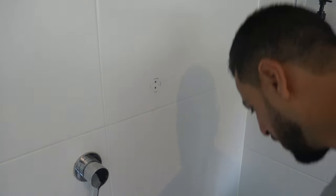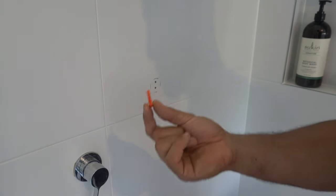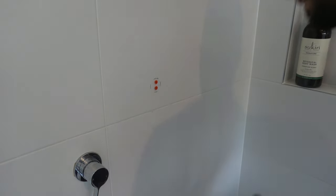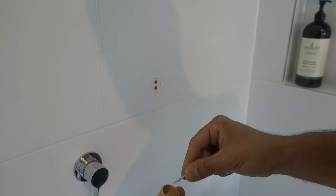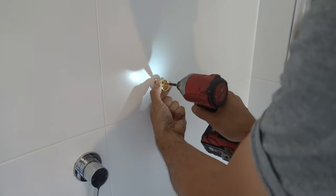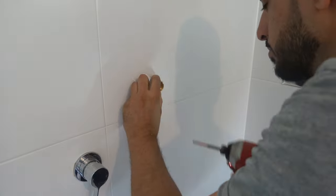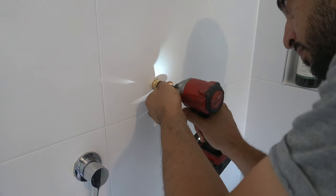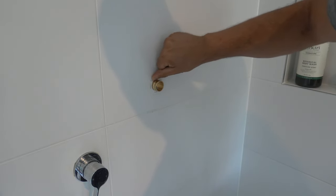I'm using a 5mm drill bit, and I personally don't like using the plugs and screws that come with these kits — I always use my own. So we've got a 5mm Ramset plug here. Push that in, same thing on the bottom. Take a hammer and use the back of it to prevent damage, and tap them flat. Now take the bottom fitting, drop a screw in and attach it to the wall, doing one at a time. Make sure you're 100% happy with the position before you completely tighten it.